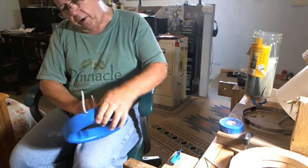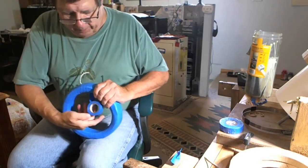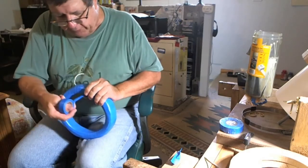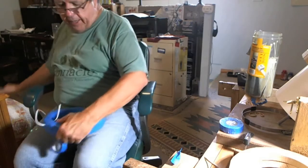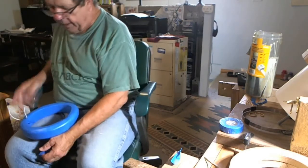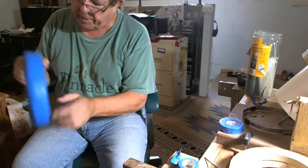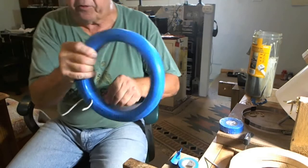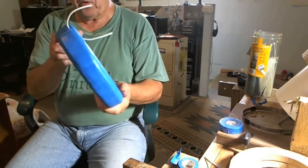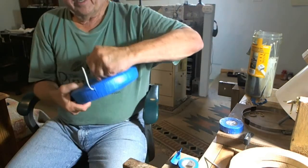Once I think I've got that area pretty well secure, I come around and go past everything a little bit. There's obviously a double or triple tape area right in this area. I get away from it and pretty much stop where I started. I try to cut it so the tape stops inside the coil, and then I actually put some glue right here — which I'm not going to do on video — and that will hopefully seal that tape forever. And here is a wound coil waiting for its cables. The next video will have to do with cables — putting the cables on and so forth.